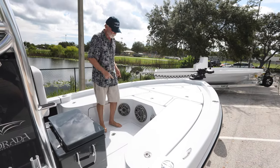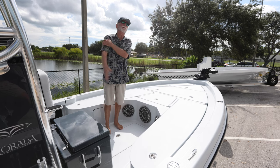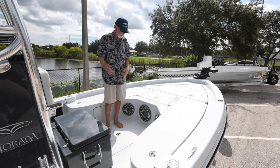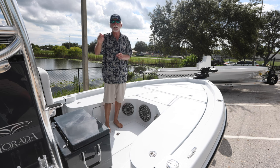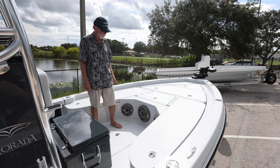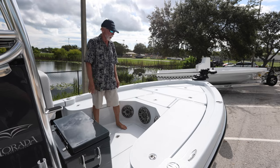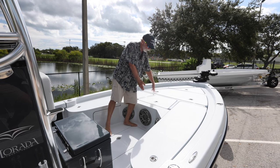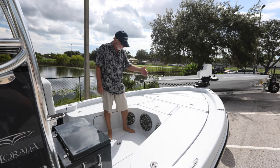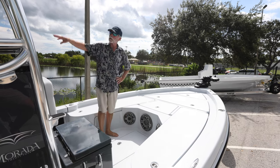With this deck configuration, we've designated where the stereo speakers go. Everything's a trade-off — I've been doing boat design work for 25 years off and on for different companies working with naval architects. It's a game of inches. This is where the forward stereo speakers now go — big enough for two 8.8 JL Audio speakers and a 10-inch JL sub. The depth between here and the live well tub is very important. We don't know yet if other brands will fit; it seems like all we do is JL Audio, but if you had another brand we'd definitely have to check that depth.